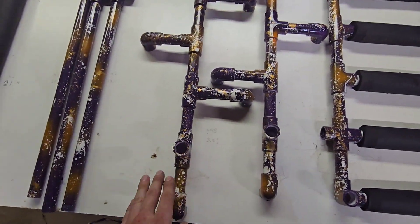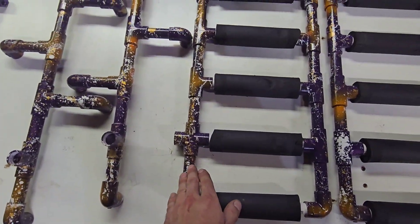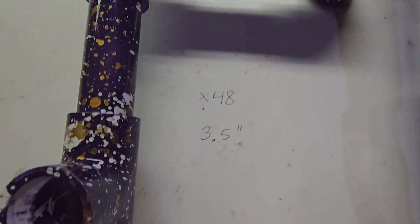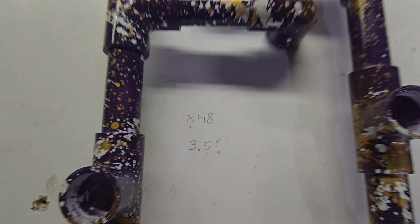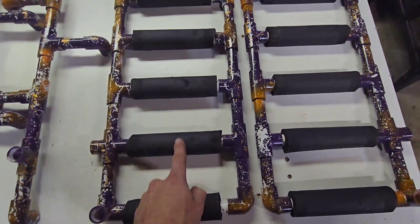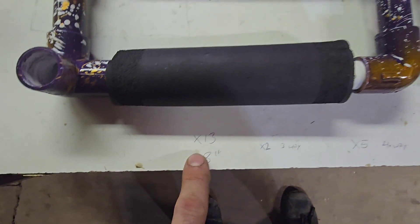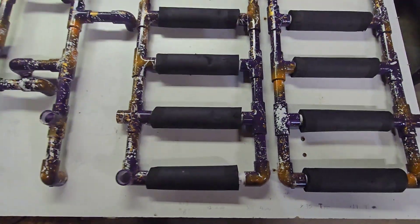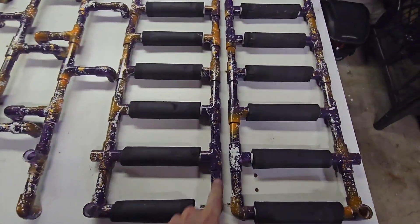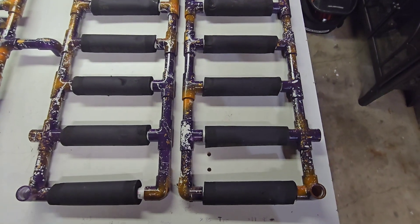Moving over to the mask rack, all of these individual sections including the ones in between your tank mounts are all going to be three and a half inches, and you need 48 of those. Moving over to the base, the pieces in between where all the tanks will sit are going to be eight inches and you need thirteen of those. Moving on to the connectors — all of your T-pipes, you'll need thirty-five.